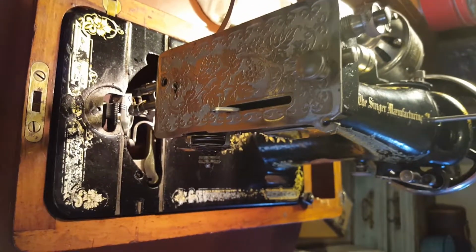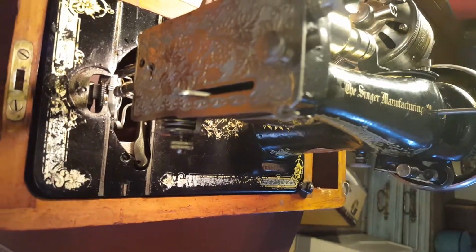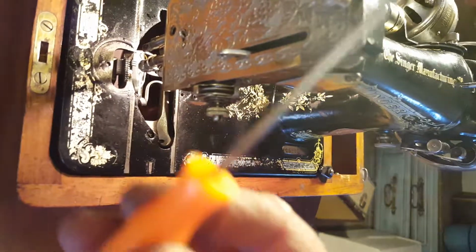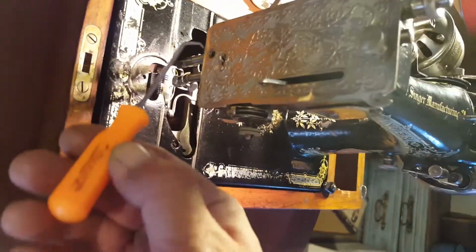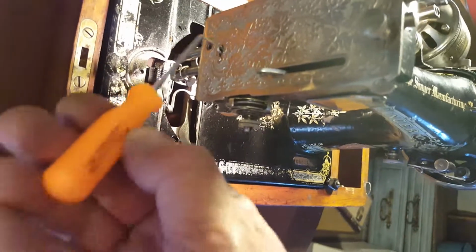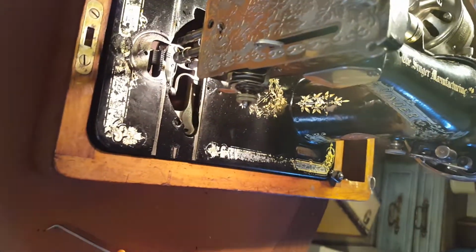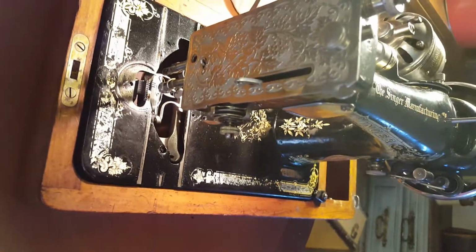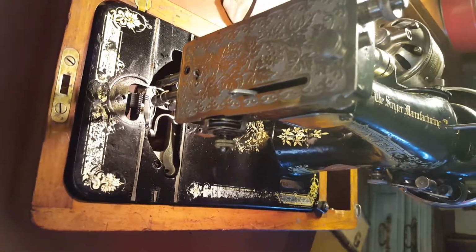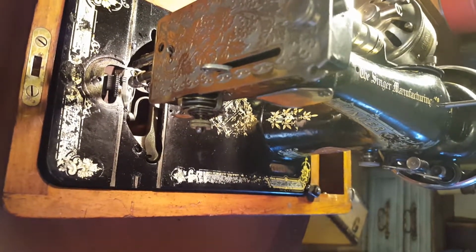I put an adjustable wrench. I pried. I tapped lightly with a little hammer. And finally what worked was going inside and picking all the paint from around the base and getting it clear. I put some oil in there, and it wasn't minutes after I'd done that I was able to start getting a little bit of movement.